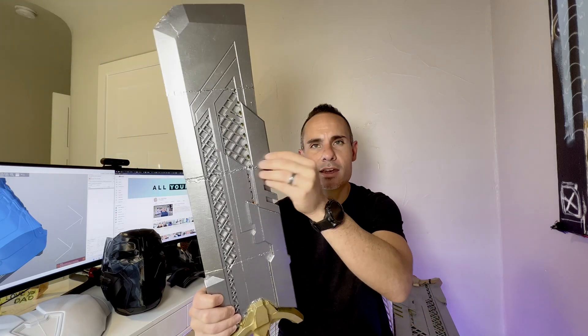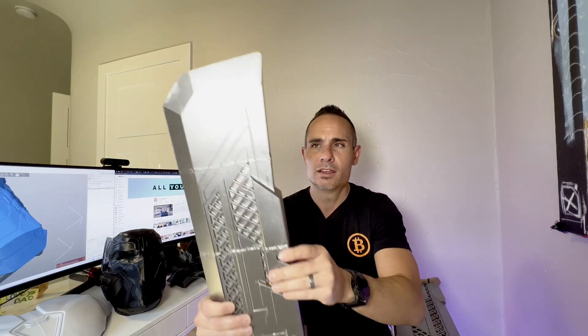When we printed this out we started using a Gorilla Glue — it's a super glue but it expands a little bit. The problem was that it expanded and started to flow out of the seams when we stacked the pieces together. It also didn't adhere as well as I'd like. We printed this out of PETG, though honestly PLA or PLA Plus would have probably been a better choice. We did end up sanding and getting it fairly smooth, but then the parts started breaking — anytime we swung it around even a little bit, the pieces would break apart, and I think that's because of the glue.